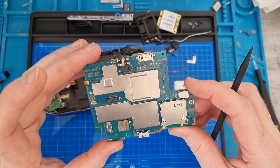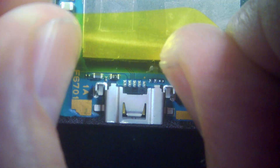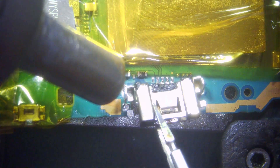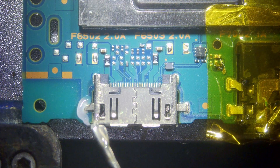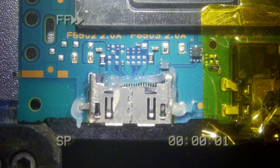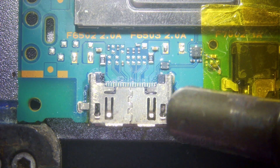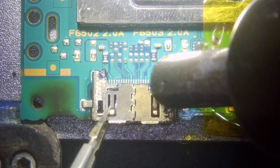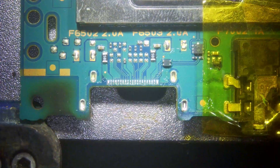The motherboard looks in pretty decent condition — I don't see any other damage, so I'm hoping the port is the only issue. I start covering the plastic parts around the port with Kapton tape to protect them. Then I realise I took the wrong port off first — I'll come back and fix that later. With the correct port now masked off around the edges, I apply a lot of hot air all the way around 360 degrees. The port is already really damaged so it doesn't matter if we're melting it. I keep moving the heat around, making sure I'm getting to the corners where the solder legs are, until it gently lifts away. As always — don't pull it, you don't want to rip any traces.